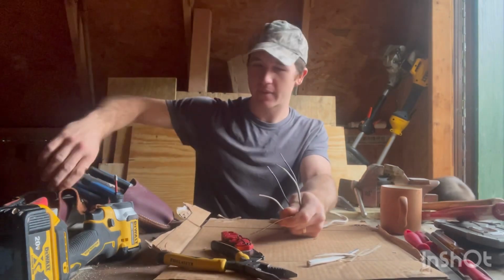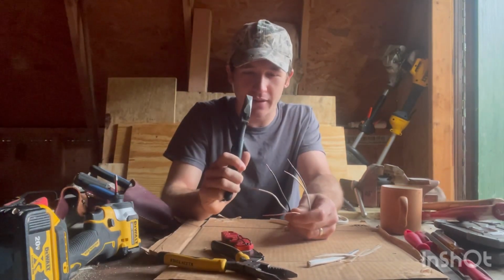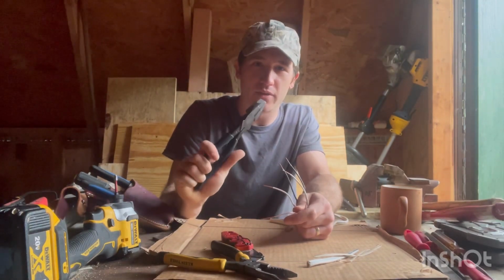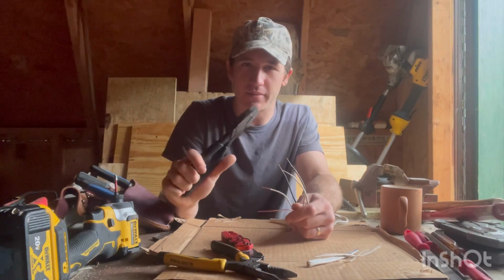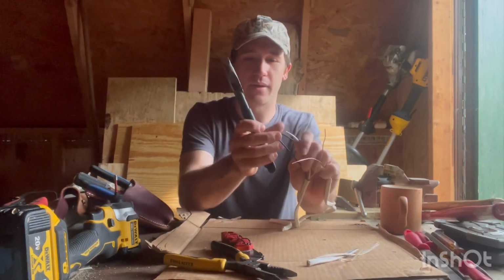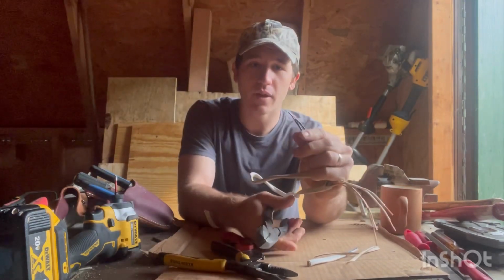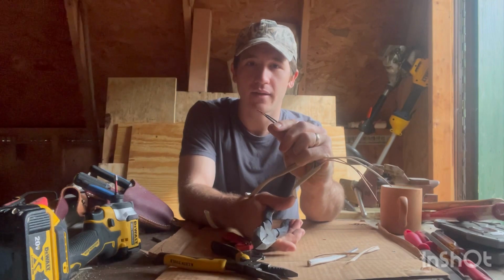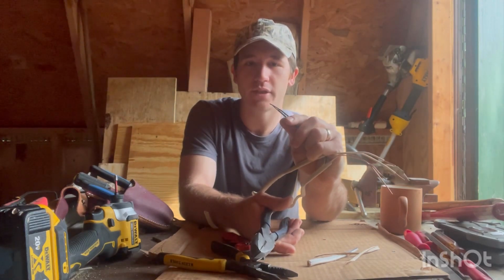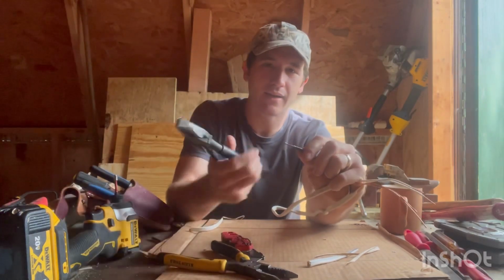All right. So you strip them, then you take your linemen or your Kleins. I wouldn't waste my money on anything other than Kleins when it comes to these kind of pliers, but that's just me. Take your Kleins, you line up your copper, so like, just so you can see clearly. You're lining up that copper like that, okay? So you've stripped off about a 1/4 inch, right?